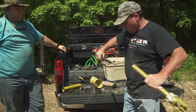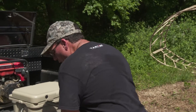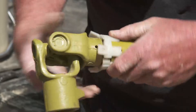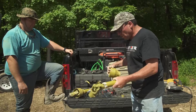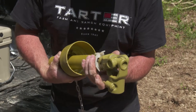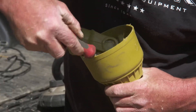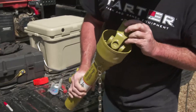You should get a good movement. Once you ensure that your deburring is done, we're going to put the shaft back together. We put our inner tube in, our protected tube. We want to line up our slots and our holes. Each of the white plastic will snap into its place. Once you get that into place, you're going to take the right coupler — they're different sizes because the PTO shaft comes in different sizes. Once you get it up in there, we're going to lock this back into place. Make sure the white tabs have caught — this keeps it from coming back off and holds it secure. This one's all snapped back together.